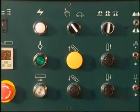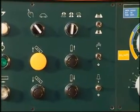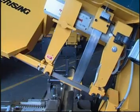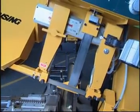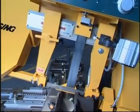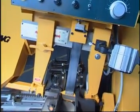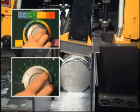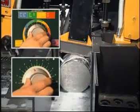Easily identified symbols for the switches, push buttons, and counters of the control panel. The fast approach device has the saw frame descend to the workpiece quickly before the blade starts to cut. The feed pressure valve adjusts the pressure with which the saw frame descends when cutting stock.